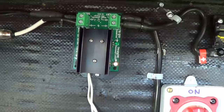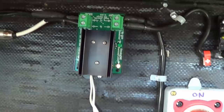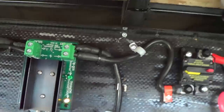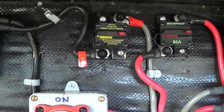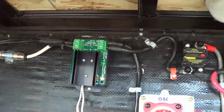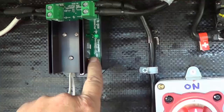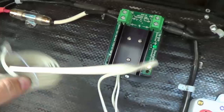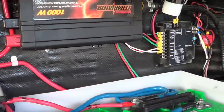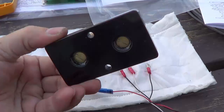So I've mounted the SC2030 controller in place of my Renogy one, and you can see it's got the solar power coming in here — positive and negative hooked up to there, and positive and negative going out to the battery. On this side there's the 40-amp breaker between the controller and the battery, and between the solar and the controller I have a 30-amp fuse just for protection. I haven't hooked up any metering or anything — I just wanted to hook it up and make sure it was working standalone, and it looks like it is. I got the charge light lit up properly. So I got my telephone cable in there that's going to go to my monitor inside, and I'm going to have to hook up my temperature sensing down at my battery bank.